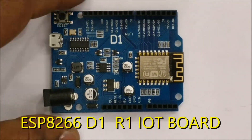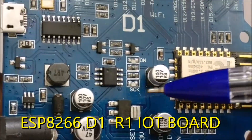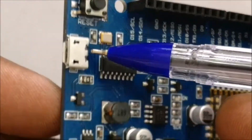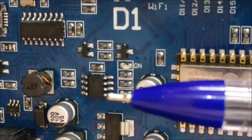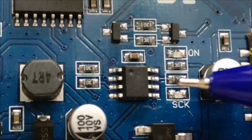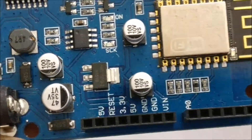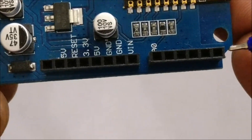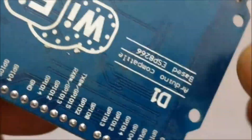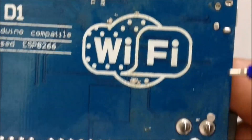In this video we will explore the ESP8266 D1 IoT board, which is an alternative to NodeMCU. It is built on the ESP12E IC and has a USB socket for power as well as serial communication. A separate power adapter is also supported. There is an onboard 3.3V regulator, so you can use an external adapter up to 12V. All pins are extended — Reset, 3.3V, 5V, Ground, VIN, and the one analog input pin A0 of the ESP. The board build is just like Arduino, and as such you do not need an Arduino board to work with this board.